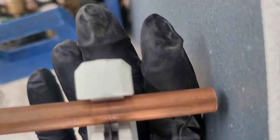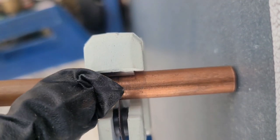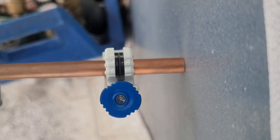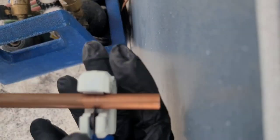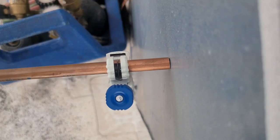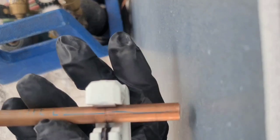You've got to be careful when you start cutting - you can see right here where it starts spiraling kind of like a screw. You've got to make sure when you're cutting it doesn't do that. These are so small that it's a square cut you need. You want to turn it like an eighth of a turn every time you tighten it, then cut your copper. Go an eighth or maybe a quarter turn - anywhere between an eighth and a quarter, just feel it yourself.